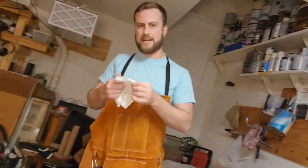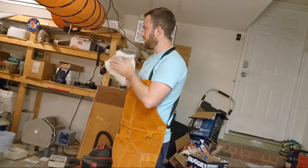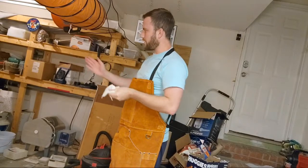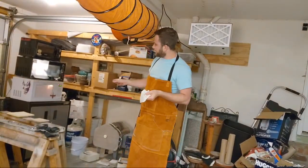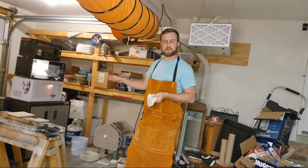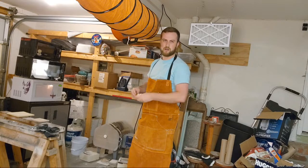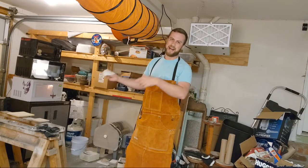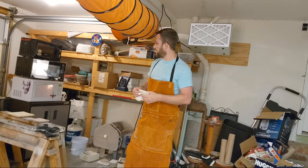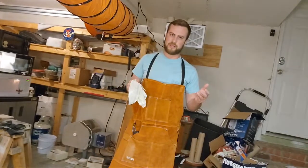I'm just going to wipe off my hands, and I'm going to be monitoring this for a good bit here. We're going to just check for the first 15-minute interval that this is going to work, make sure that we don't have any issues, and once we do that, we're going to immediately be removing that and putting it into the 900 watt. Following that, we will be moving it back to the 1100 watt for another 15 minutes, and that should complete the sinter cycle.